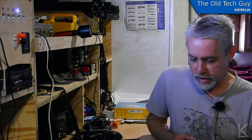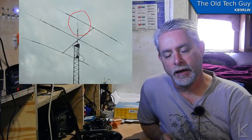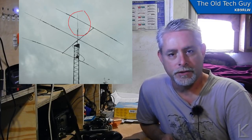So to give you something to watch this week, I have a short one today. Al, the gentleman with the Cushcraft beam, had another problem the other day. He came out in the morning and went to fire up his two-meter radio. Up on the mast on top of his tower he's got a vertical tri-band antenna — 6, 2, and 440. Fortunately, he was looking at the front panel of his radio when he keyed down, and he saw the SWR indicator go all the way up. He let up right away and said, uh-oh.